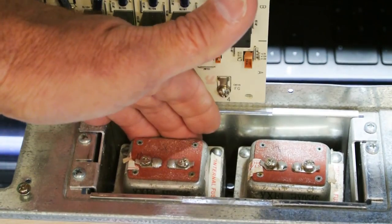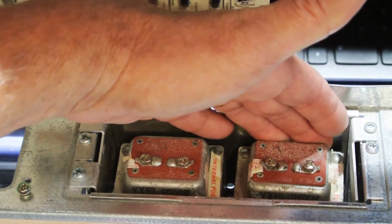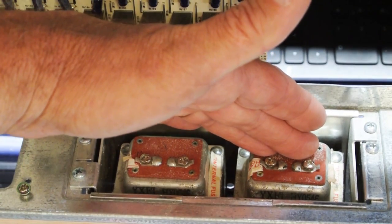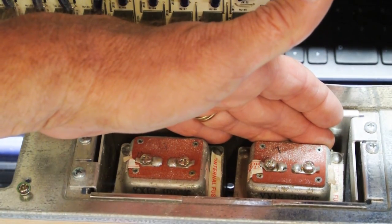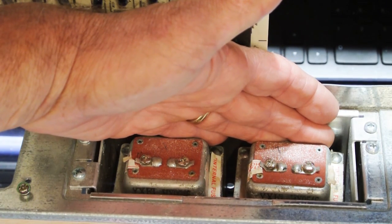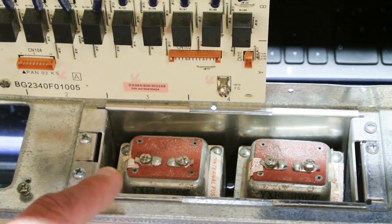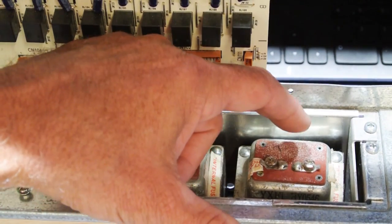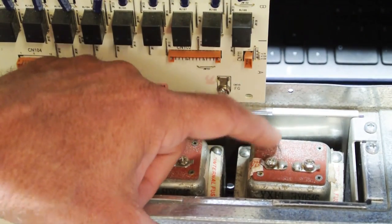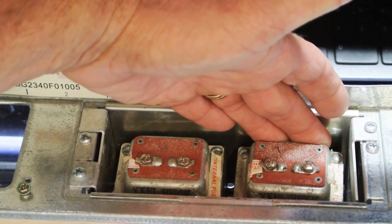So after the heat test, if one transformer is slightly warm and feels good but the other is burning hot, that may indicate a failed transformer or a problem with the 4406 master station. In systems with dual transformers like the 3303 and 4406, it's possible for one transformer to fail without causing an obvious visual sign on the master station — there will be functions that don't work, but you may not notice just walking by.